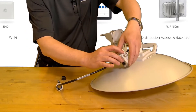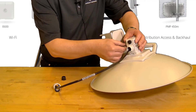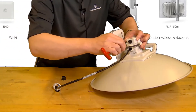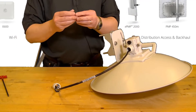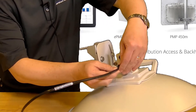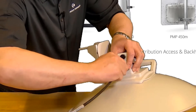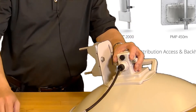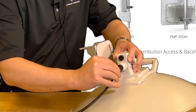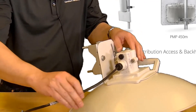Loosely install the sealed cable cover, engage the built-in locating guides, and slide the cover into place. Tighten the captive screws a few turns with the M5 hex driver to keep the cover in position. Install the two halves of the rubber seal around the cable close to the body of the gland, then push the seal into the gland body as far as it will go. Slide the compression ring onto the rubber seal and press it into place — it should seat against the gland body. Then thread the retaining nut onto the gland a few turns.